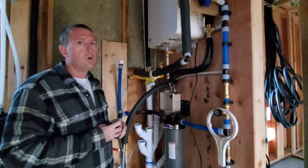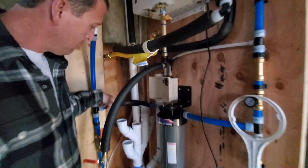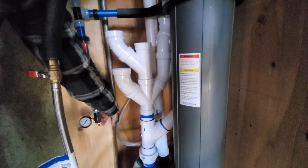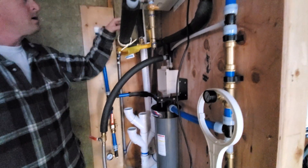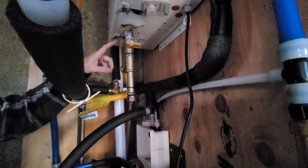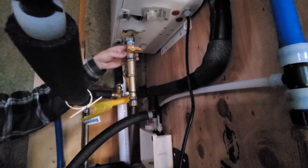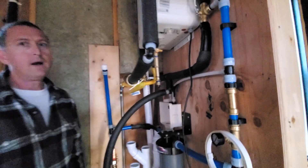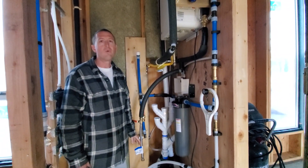One final thing to note regarding the tankless — the gas line. You may notice this yellow line sticking out here. On the other side of this wall down here is the propane regulator. It comes through a stainless steel pipe, up through a flexible appliance connector, into a gas sediment trap, and it has a shutoff valve. If you need to take this unit out, you close this valve — it's closed right now — and you can shut the gas off that way. That about covers how the hot water system works.